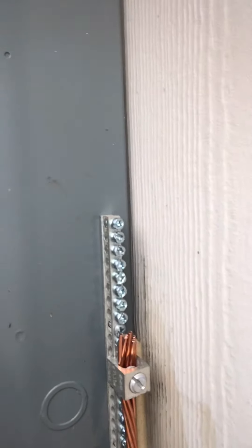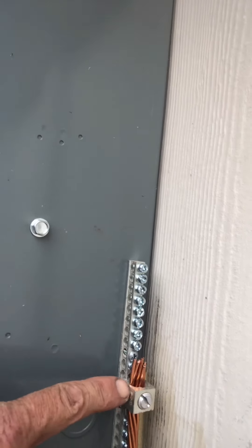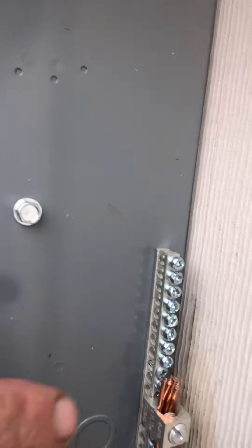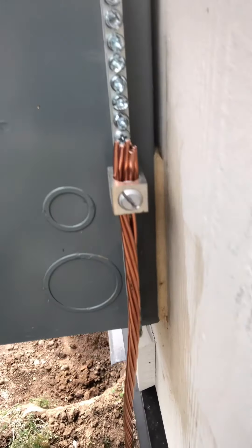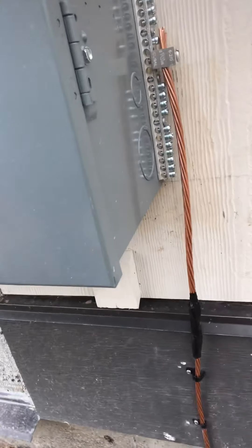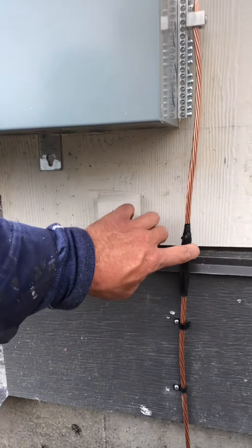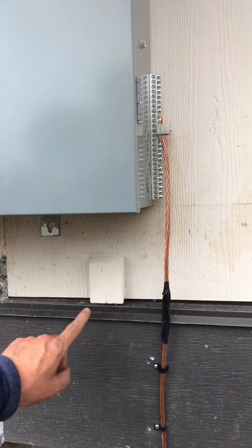This component is called a lug. We unscrew two of these screws and then insert this lug, which allows the thick number two wire to be received — the wire goes in here. We also have some trim here; you can imagine if electrical current traveled down into this aluminum flashing, the electrical charge would follow it, which we don't want.